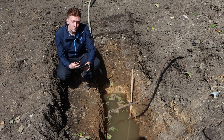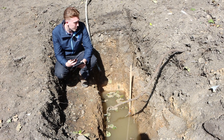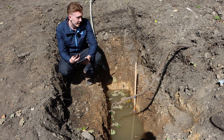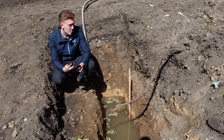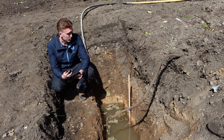It's taken approximately two hours to drain to the 50% fullness marker. It is taking its time, which is most likely because of the underlying geology of the site — it might have a bit of clay, which obviously limits infiltration.